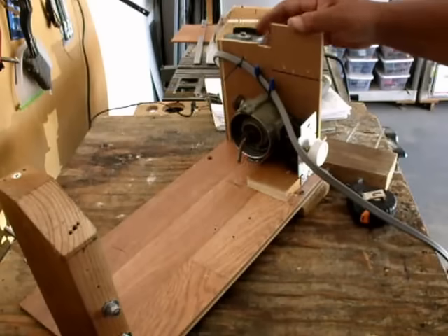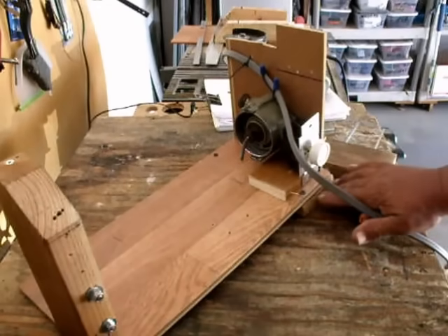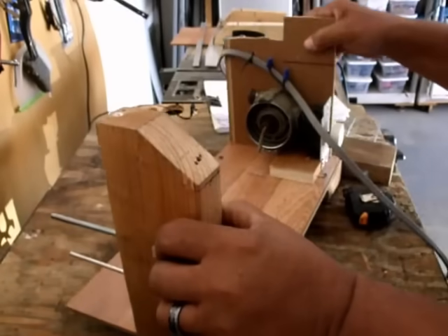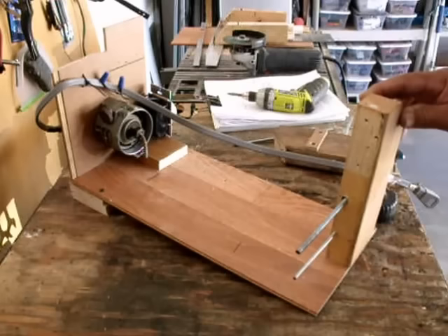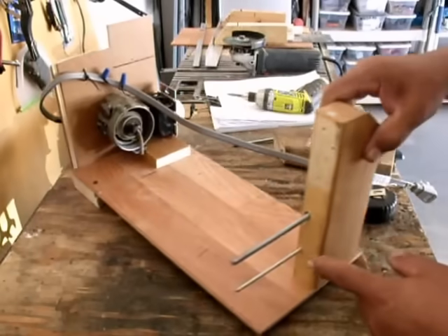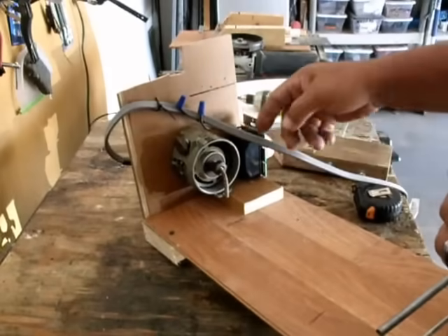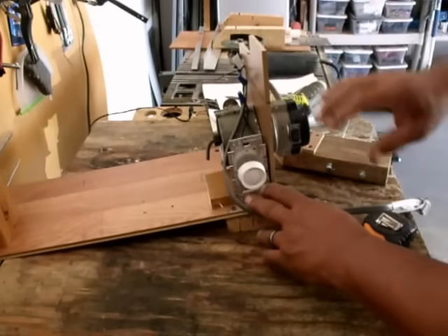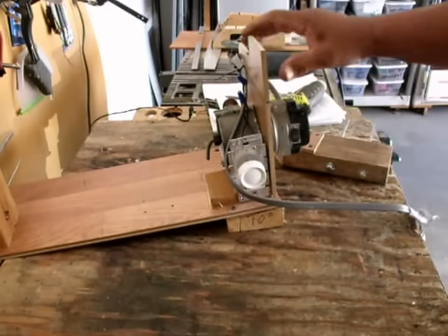The first part you're going to need is the base. You've got your wood here — a two by four — so you have a slight slope. You drill quarter-inch holes so that you can run your adjusting screws all the way through. You've already drilled the hole for the motor, put the motor through there. You have a dimmer switch, so the dimmer switch will control the amount of vibration you get from your motor.